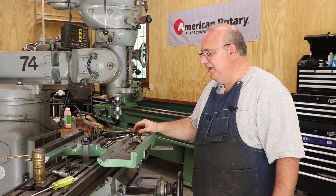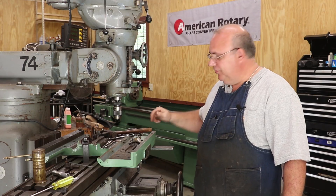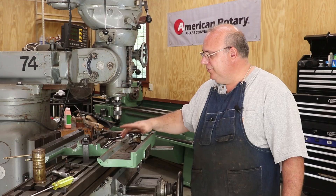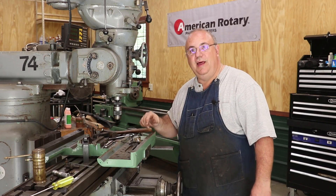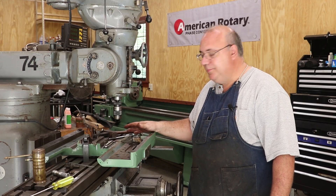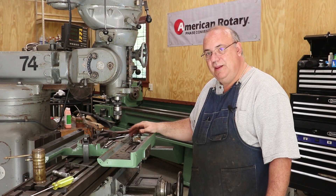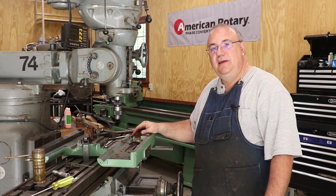That's going to be a wrap on this one, guys. As always, thank you for watching. We're going to get this apron salvaged. I was really worried about getting this hole punched through, but that actually was pretty easy. Getting the oil ports opened up wasn't as bad as I thought either — thank goodness I marked them well so I could find them easily. Now I just have to get these oil lines opened up to get proper lubrication back on the saddle and apron. With that restored, I think it's going to last a lot longer, particularly since the bearings failed mainly because of poor lubrication. We're going to fix that. Thanks for watching — we'll talk next time.